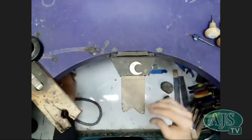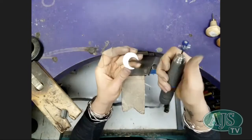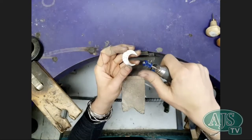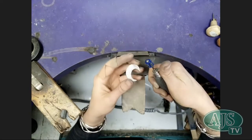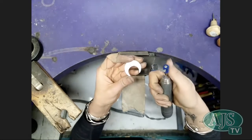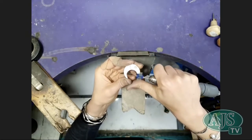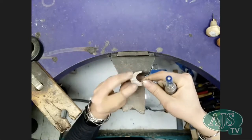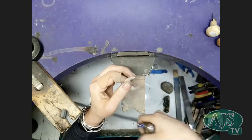And if I wanted to blend those in, because I want to make sure that that texture's all over the back of that surface, I use this little texturing wheel here. Again, you absolutely have to have safety glasses on when using this, because these little metal arms, they come flying off and they absolutely shoot up and down your face. So 100% only use this with safety glasses. All right, and let's just run that over that surface. It's just adding this stippling texture, which blends that with that sand casting texture wonderfully. There you go, that's all I needed because I only had a little bit.